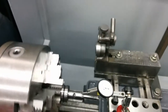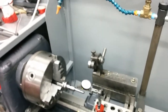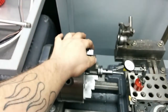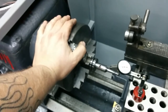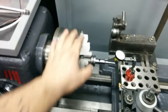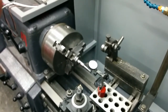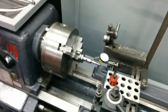I am super happy that turned out the way it did. I read a bunch of stuff where everybody was saying clean the chuck first, clean it first — there might be a chip stuck somewhere. I always told myself that's probably not the case, it's probably just worn out or whatever. Well, that was not the case on this one. I cleaned it, put it back together, and bam — I checked the original runout multiple times: 16 thousandths, which is crazy. Now it's down to one thousandth, which I can live with all day long.